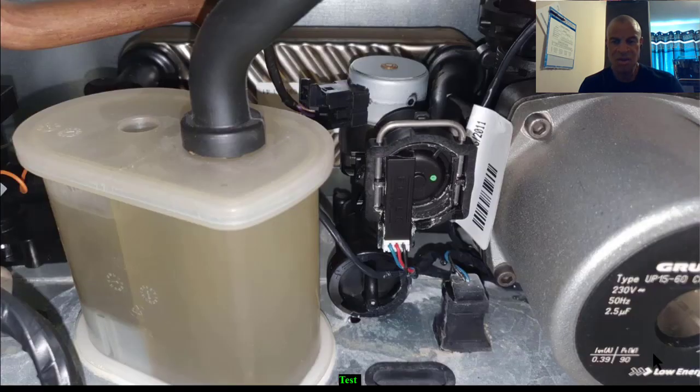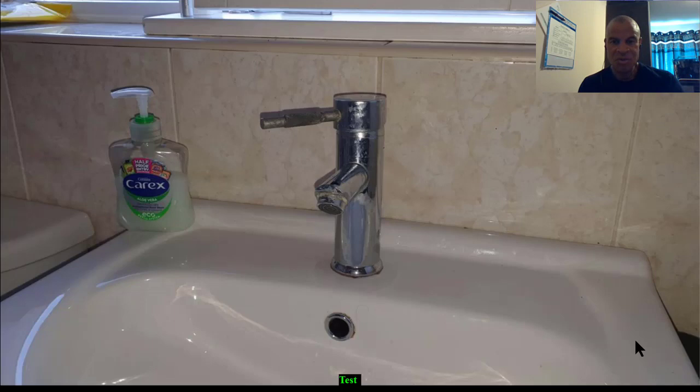The plug's back on and we're ready to turn on, but before we turn the water back on we need to make sure the hot tap is closed. We do that because we don't want pressure build-up when we're not in front of the boiler. If there was a leak and you left the tap open, the pressure will build up and if there's a problem you won't be at the boiler to sort it out immediately. Always close the tap first before you turn on the mains inlet pressure.